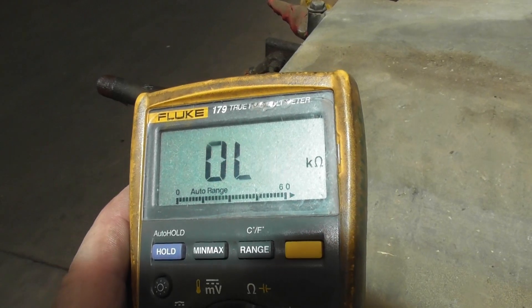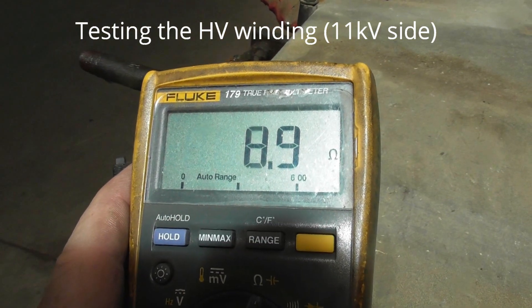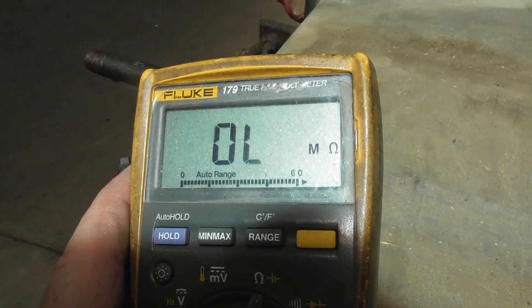You can go red to blue please. Red to blue. This is on the 150 kVA transformer. 8.8 — the same. And yellow to blue please. Yellow to blue. That's on the 150.